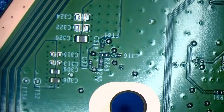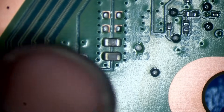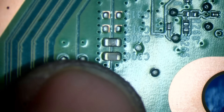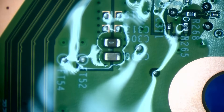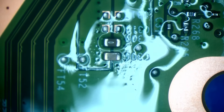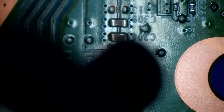There you are — felt heat right there. I can see it now. I didn't spot it before — this is exactly why visual inspection is important. That's going to be the cause right there: C306. Let me grab a bit more IPA to clean it up. Now that I'm actually looking at it, you can clearly see the burn mark on it.